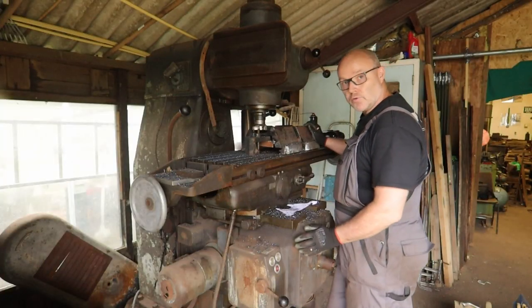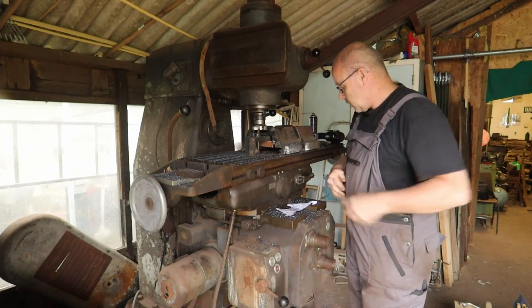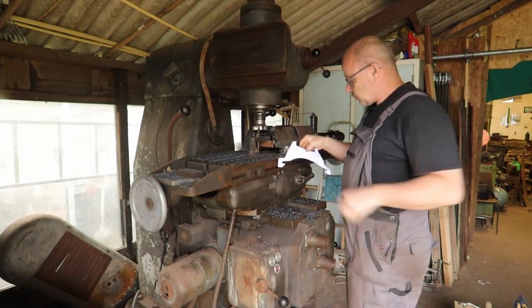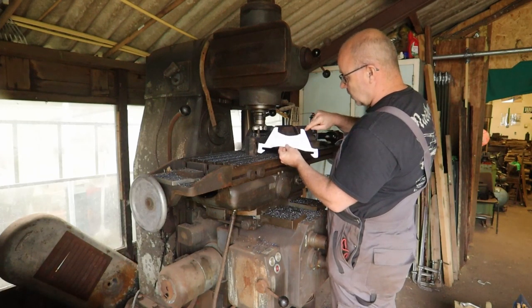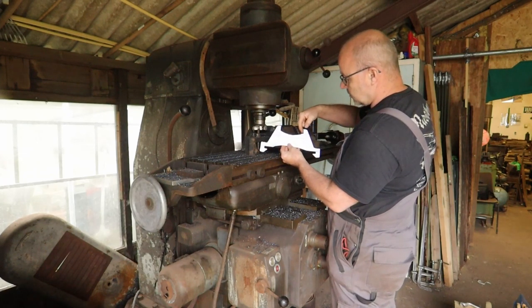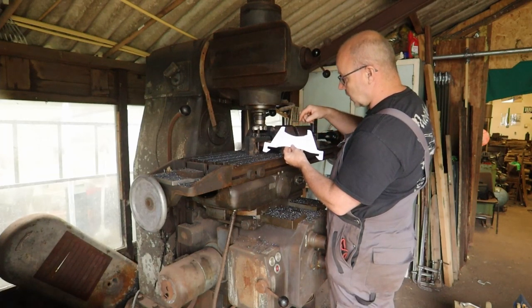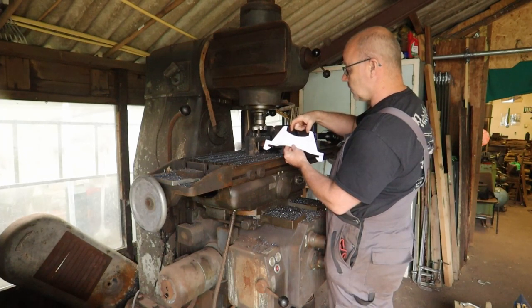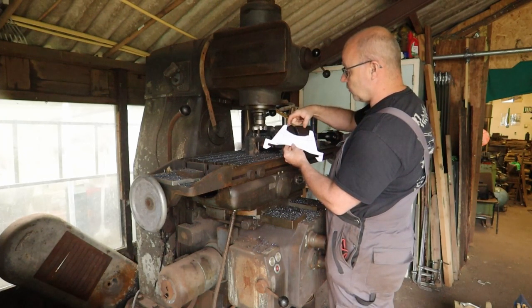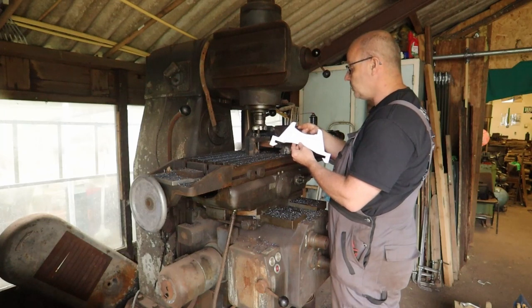So I have taken down a few more passes. There are a few things that I'm trying to do. This is a cross section. I'm going to mill straight down till this corner, because the way this is now set up, it will be flat and cutting about this width. Then I'm going to move over and do the same here, but a little bit deeper, and then move back again, so that everything is at the same plane.